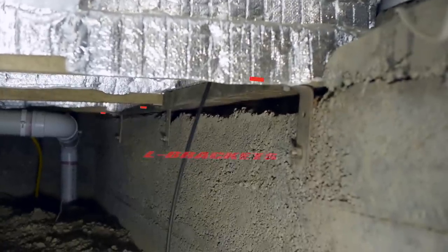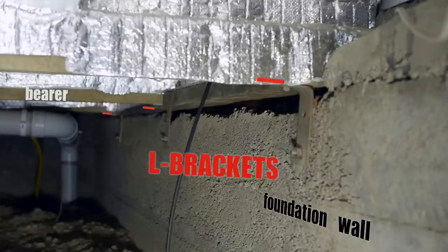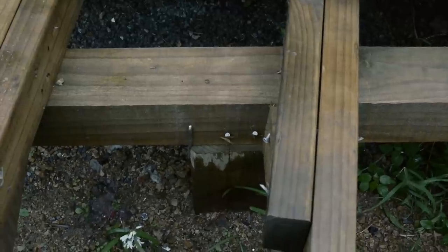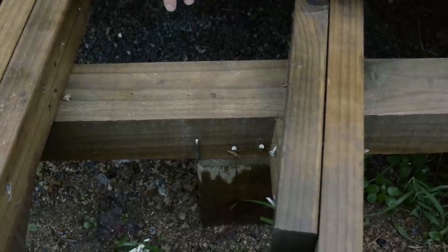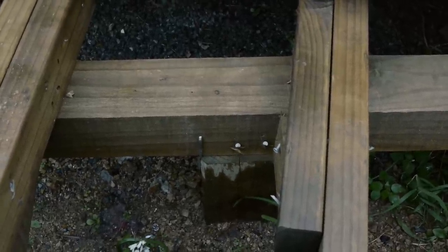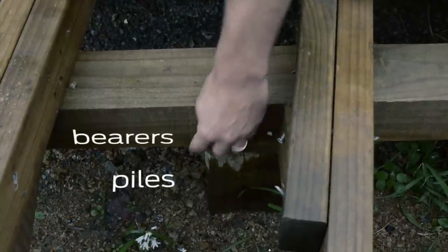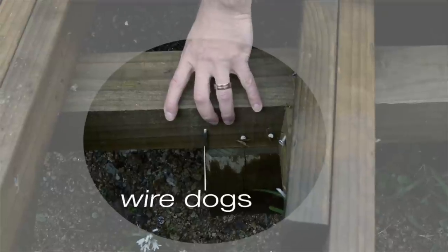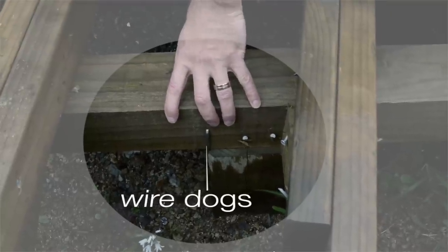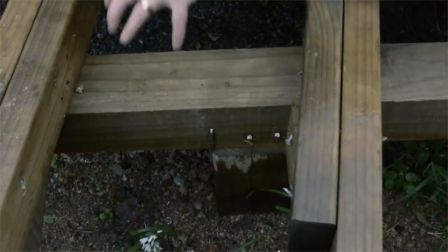Under here is an engineering L-bracket that bolts a bearer onto the front foundation wall, giving a strong positive connection so that wall won't separate from the house. When we built the deck, we made sure the piles were down a few hundred millimeters to have some shear strength, not just load bearing. The pile is attached to the bearers with a pair of wire dogs on each corner to give shear strength, so the deck can't shear away from the piles.